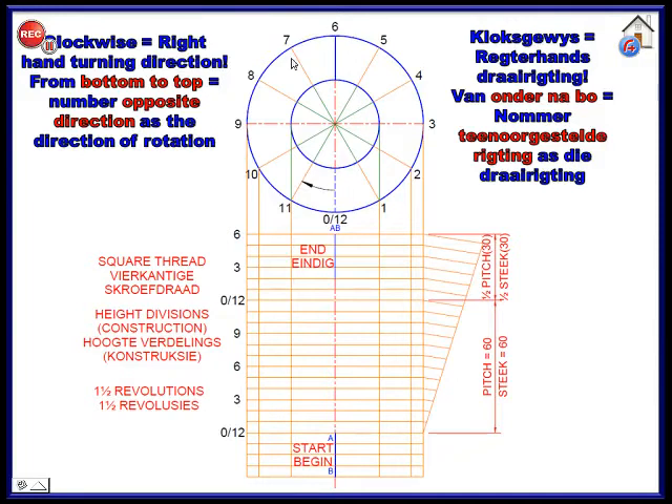You're going to draw a circle around it. The circle on the outside has a diameter of 80 and the inside is 40, which leaves 20 on each side. The 90 comes on top of the 20. For 18 spaces: 90 divided by 18 gives you 5mm per space. For the 20mm section: 20 divided by 5 gives you 4 spaces. So you're going to have 4 plus 18 which is 22 spaces in a total height of 110 (which is 90 plus 20).